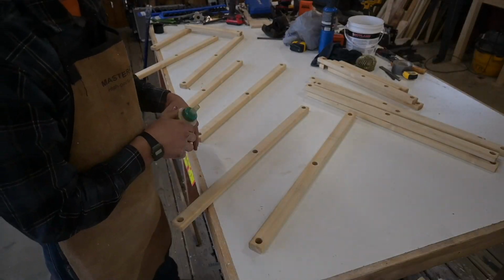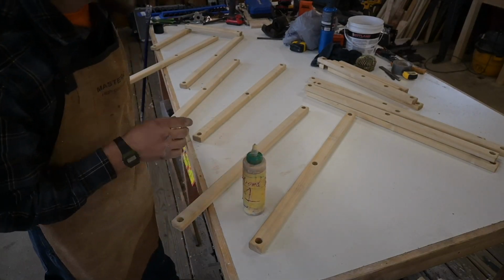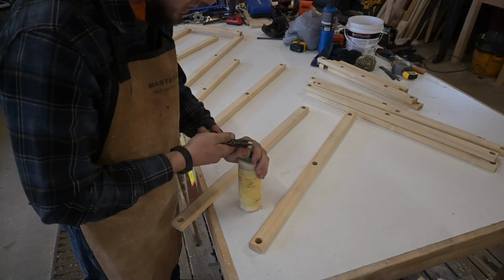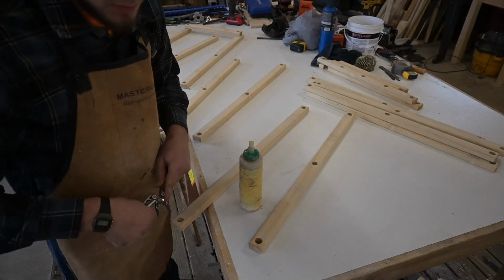This is where I wish I had some Type 2 too. This would be a perfect place to use Type 2, which is water resistant but not waterproof. But, you know, it's a drying rack, so it may get some moisture on it occasionally. So Type 2 might be a little bit underpowered, but Type 3 would be overkill. Anyway, I'm going to use Type 1. It'll probably never get wet. Hopefully it never will. And we'll be fine.